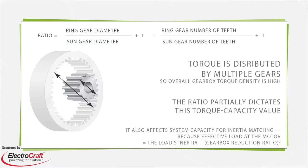In contrast, the gears in planetary gearboxes usually have at least three gear meshes in action. The inherently balanced nature of these mesh gear points works to keep lubricant well distributed, which in turn lets planetary gearboxes in some designs accept input shaft speeds exceeding 10,000 rpm.